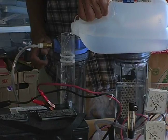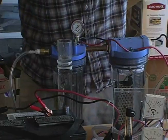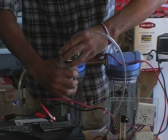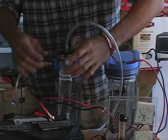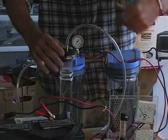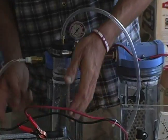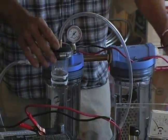What's neat about the bubbler is you can see the hydrogen bubbling up through there. That's really cool. So, put our cap back on. Remember, our cap doesn't stay tight — it's a safety device. If there's an accidental backfire through here, the cap will pop off. It won't backfire through the water and it won't come back into our container.